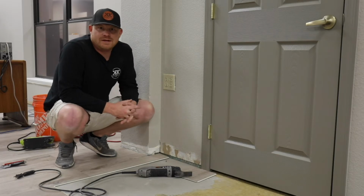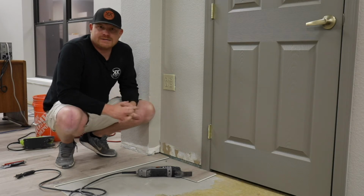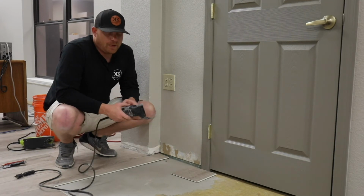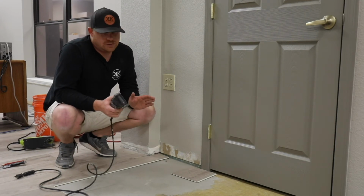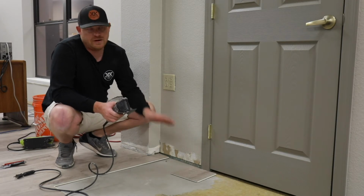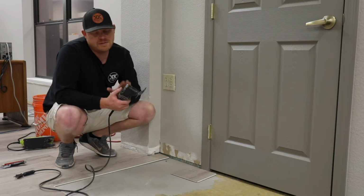Hey guys, it's Shelton Keith, Keith Family Flooring, coming back at you with another video. Not really a tip video this time, guys, but something I highly recommend when you're doing your own floors at home, having one of these multi-tools. They're tremendous for cutting under door jambs and putting your floor underneath there. It's a nightmare to try to cut around those door jambs. I highly recommend one of these.